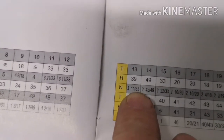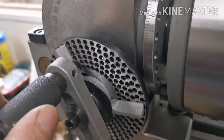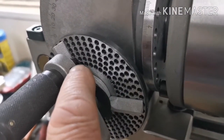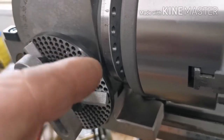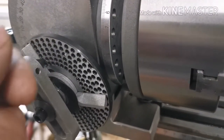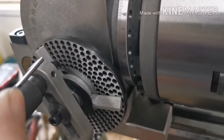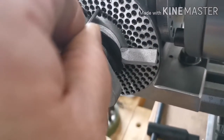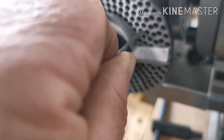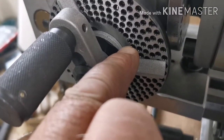I've got all this set up — you can see the pin is in one hole. So when cutting the 13 teeth, you have to go three full turns and 11 holes. After three turns, you count: 1, 2, 3, 4, 5, 6, 7, 8, 9, 10, 11 — and that is where you put the pin on the handle for the second cut.